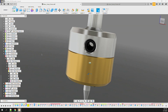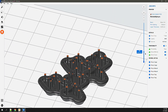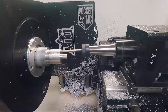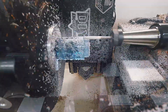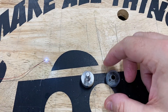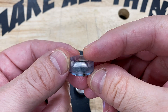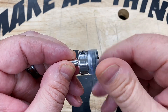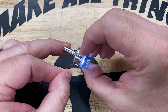With that, final versions of the parts were printed on the Form 3 using PreForm and their black resin. The parts were cleaned in IPA and post-cured to harden the resin. The simplified probe body was milled on the Pocket NC from aluminum, and this time around I decided to mill the nose from a clear blue acrylic rod to allow the LED to illuminate the nose when probing. Milling on the Pocket NC is super handy for these types of parts. When finished, the aluminum was sanded and polished, and the plastic was sandblasted so it'll act like a light pipe for the internal LED.